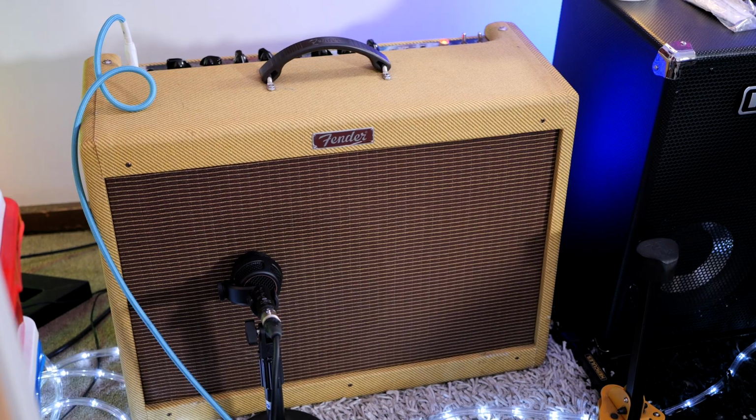As you can no doubt hear, both tones sounded great with both microphones, so no problems there whatsoever. But the character of each microphone is different, and again, I'll talk more about that at the end. What I can tell you is the OD5 is so much easier to mic up a cab with over the E906. Now, if you're a bassist and you've got a cab that you want to mic up and you don't use a DI out, this microphone will definitely do the job thanks to that 20 Hz low frequency response.